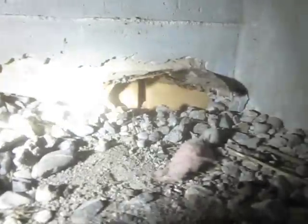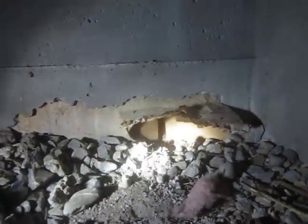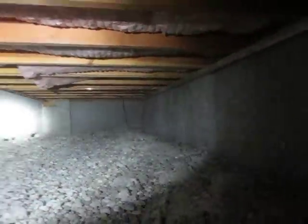Flexible material. Here are the cells of the void material, which create a void below the grade beams — between the bottom of the grade beams and the soil. Here's the void here. Here's some of the material that's still left in place. The foundation looks good, all the way around.